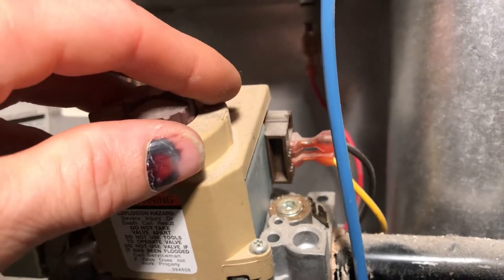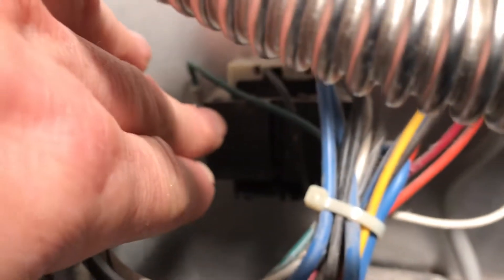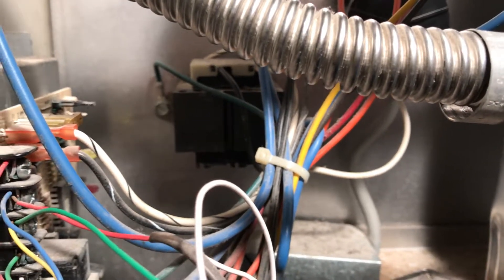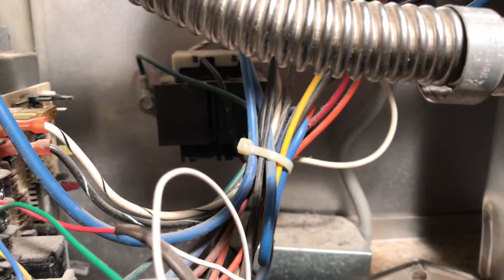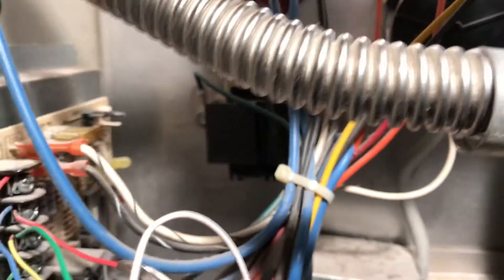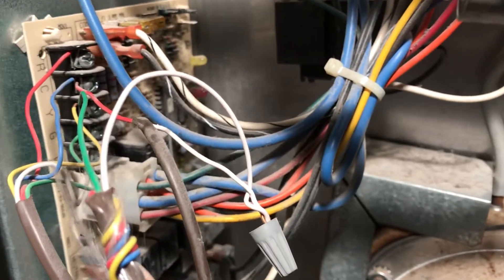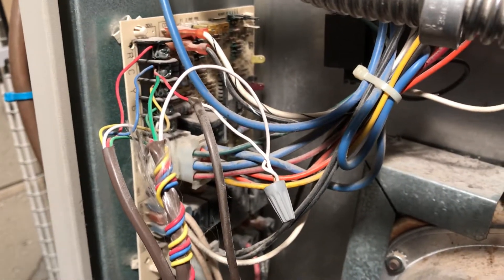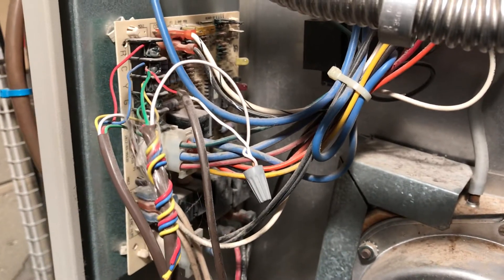This is your gas valve. Back there — that's a relay. Right there is a transformer. It is taking 120 and changing it over to 24 volt. A lot of these little switches we're talking about right now — that's what they're controlled off of, 24 volt. Your wiring diagram will explain all that. This obviously is your control board right here. Unfortunately I haven't had any problems with the control board going bad — that would be a mess.